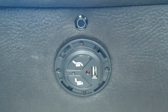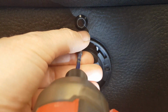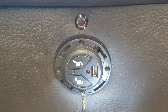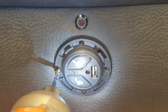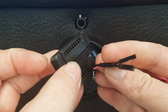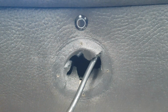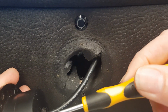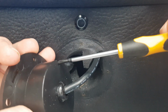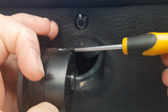So there will be a little bit more soldering. We'll have to solder the positive and negative wire onto the USB charger outlet. Just not terribly difficult. The only other little bit of soldering I did was I did make up a little Y DuPont connector just for connecting the negative wires. Just pull this apart. There you go, now you can see it. So the soldering is not really that hard, and there is just one hole to drill into the back plate here for the wires to come out.